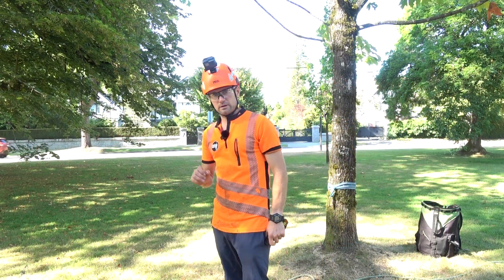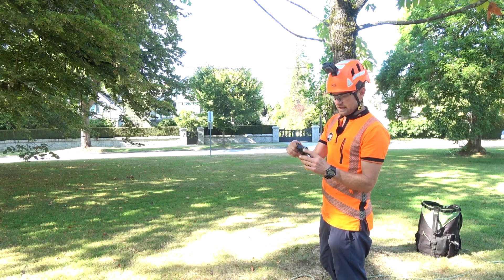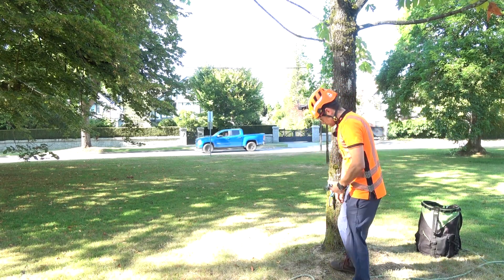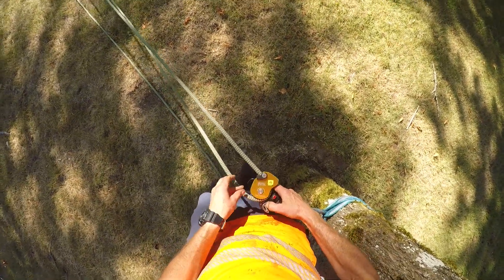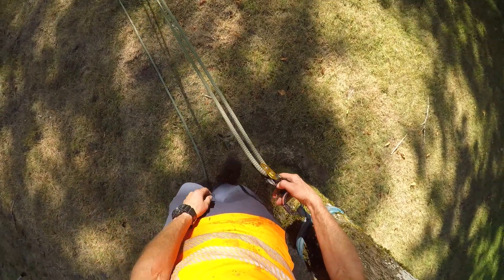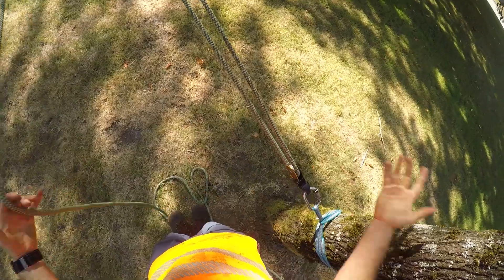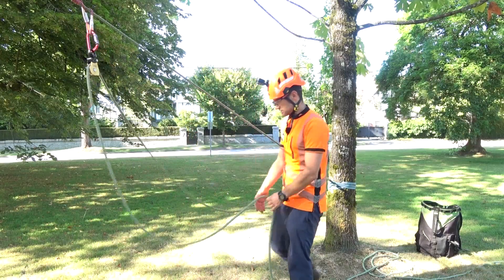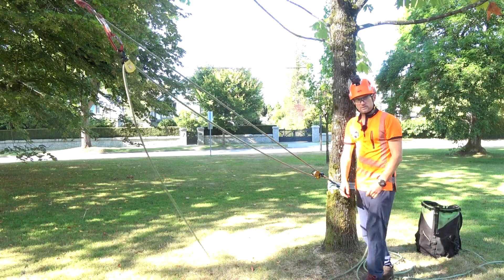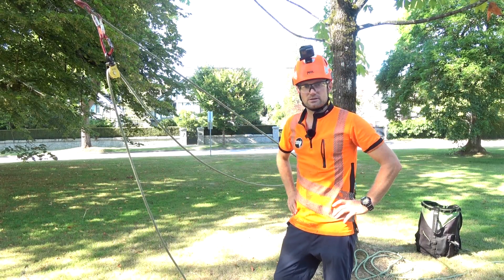Now I'm going to show my dream 3-to-1 setup. I've got the Petzl Spin on one end, and a Petzl Protraction on the other — the Protraction has a built-in progress capture. Make sure you put it in the right way around, click it in, and press the button down to engage the cam. Now it's a fairly efficient pulley for your 3-to-1, but when you let go it just locks out and the progress is captured on this leg of the line. Then you can reset your system if needed. Thank you for watching — that is a basic 3-to-1 setup; this one isn't quite as basic, but it shows all the different equipment you can use.